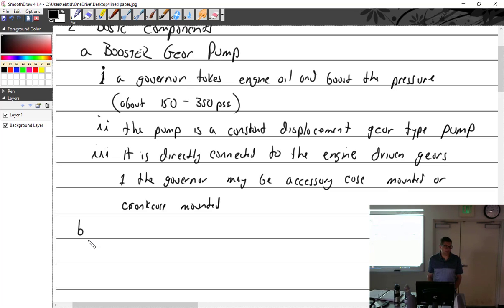When that line breaks, you're going to lose all your oil very quickly. A pump capable of taking oil at 50–60 PSI and boosting it up to a couple hundred PSI will empty out a crankcase fast. So when that line breaks, you better hope you have some Slick 50 — or STP — in that engine, the old Teflon-based additive you could pour in and supposedly run the engine without oil.